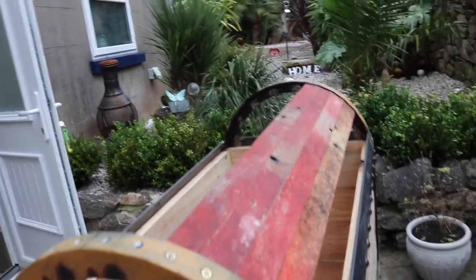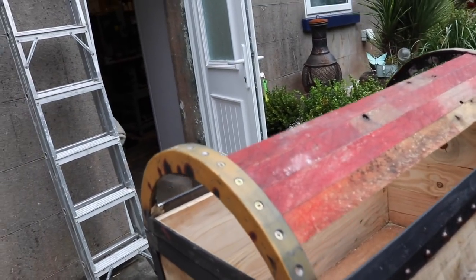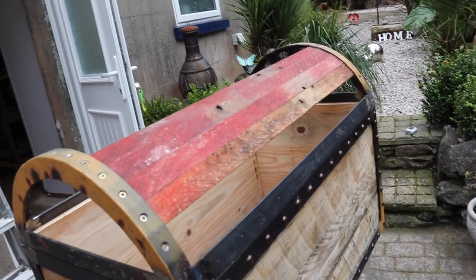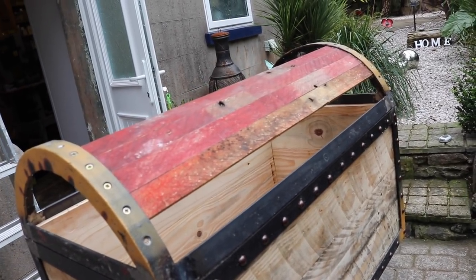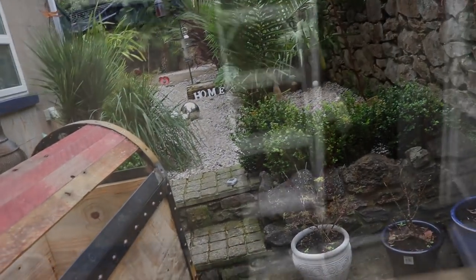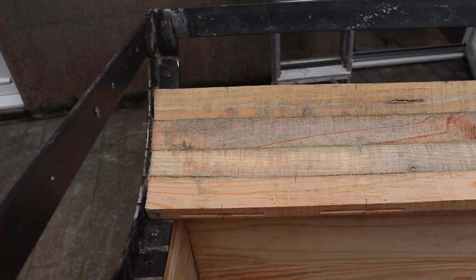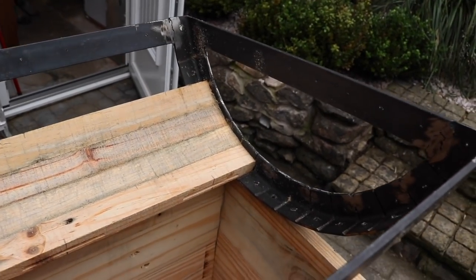Each side of these thin strips is cut at 12 degrees. Because I've got 15 pieces, if you have more pieces the angle will be slightly different. I've screwed every single one in and a cap will be glued onto the top of each screw. Because they're the correct angle they all mate on the inside as well.